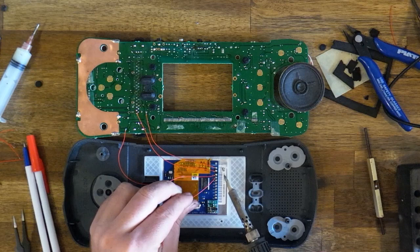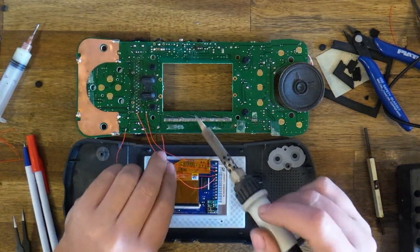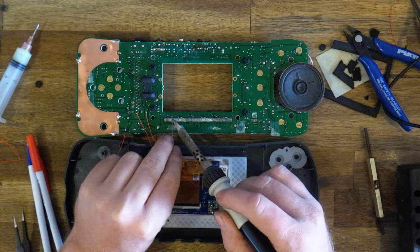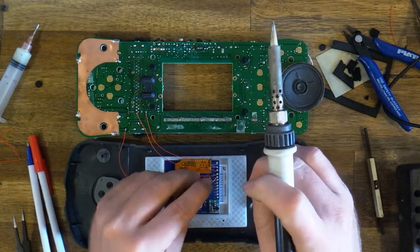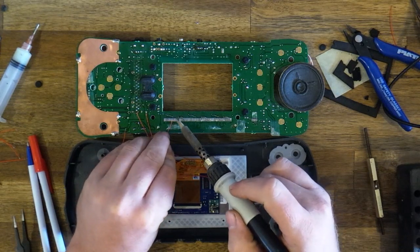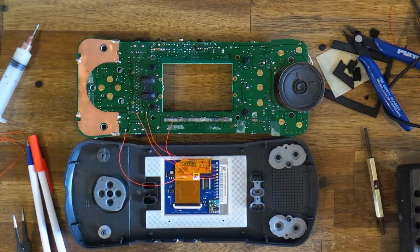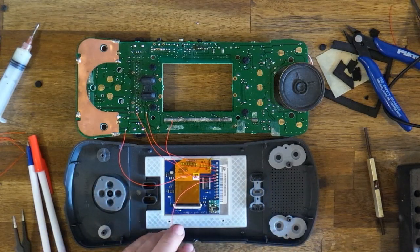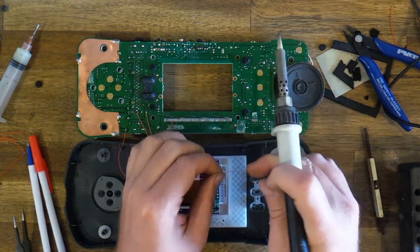Next is CL2. And on this chart, it'll be pin 3, 4, 5, 6, 7, 8. Pin 9, or pad 9. 1, 2, 3, 4, 5, 6, 7, 8, 9. Just straighten that out. Okay. Next, A3. A3 looks to be... Where's my cheat sheet? A3 is pad 53, which should be this one here.